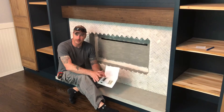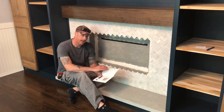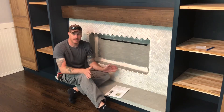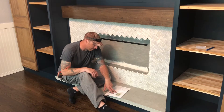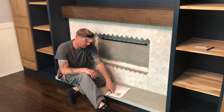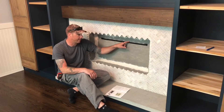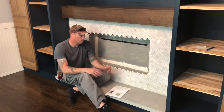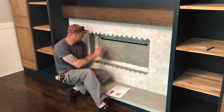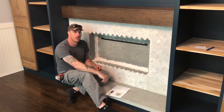This ventless fireplace is super easy to install — it just depends whether you want to install it on the outside or inside of a wall. I built my own structure here so it's inset into a wall. It comes with seven easy instructions. The first step wants you to build a box on the inside with specific criteria: 37 and three-quarter inches wide, 20 inches tall, and six and three-eighths inches of depth.